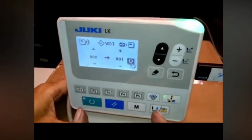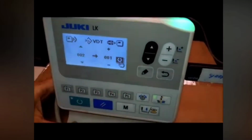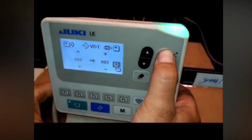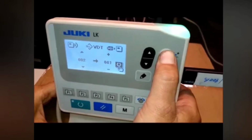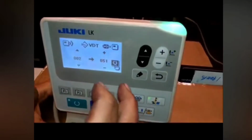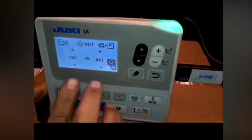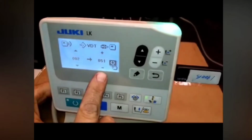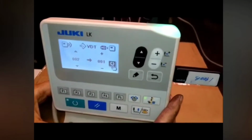Now on this system we don't really have to put it at a particular place. You can put it in the next location as one, but to be consistent with the 1900 earlier models, we're going to change this to 51. But with this system here, the computer will differentiate between the EEPROM standard and what's been uploaded. But we're just going to keep it consistent for here. So it's pattern number 2 from the USB to the panel. It's going to be 51. And when we're okay, we're going to press the ready button, and it's going to load that panel up.